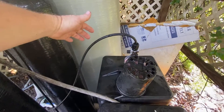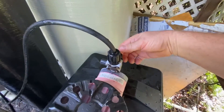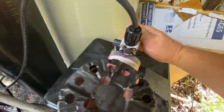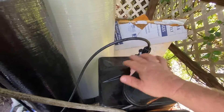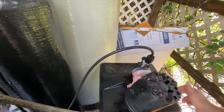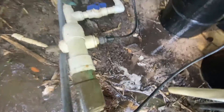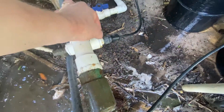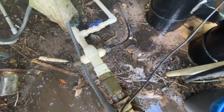If you don't see the hose moving — you can see how it's popping like that every time it pumps — there are a couple of things to check. There's a valve on the back; if you open that you should see the bleach water spitting out. If you don't see bleach coming out, either you don't have any chlorine in there, or it's not priming, or you have a clog. Usually the clog isn't up here — inside there's a long thin tube where calcium and debris build up until there's a plug.